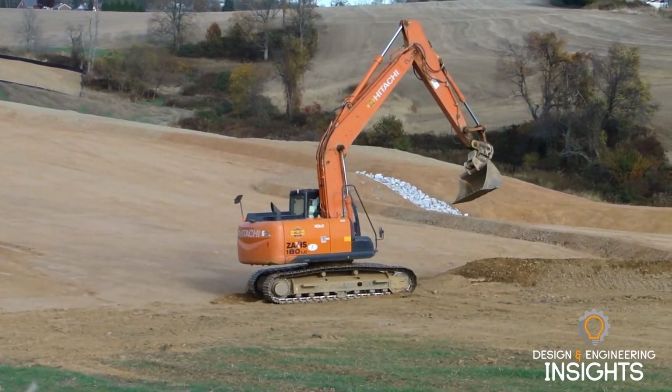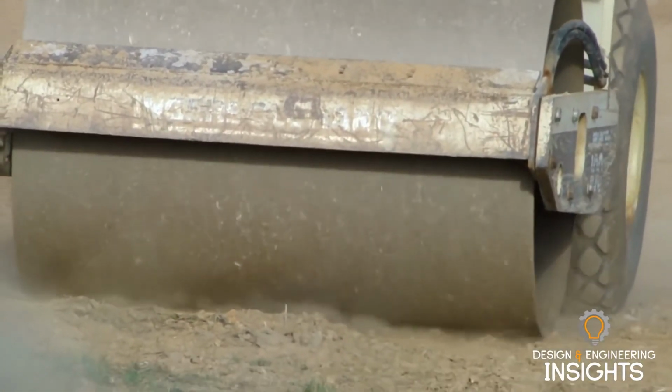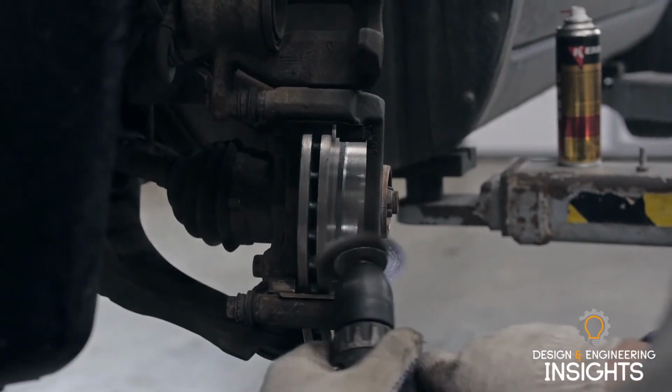And in terms of applications, there's a very wide range. Fuel controls, construction equipment for hydraulic brake retarding systems, for clutch controls. Many times there are clutch swaps that occur in transmissions, and some are more sensitive than others. And this precision control technology really can change the vehicle's performance and improve the performance for the operator. Other applications in proportional flow control could be steering cylinder control. I mentioned braking and steering, those are safety critical and very important features. So the pilot valve itself can provide that very repeatable output with low friction, and in turn create high driving forces that allow the valve to perform very robustly.